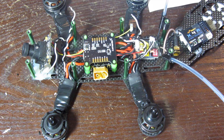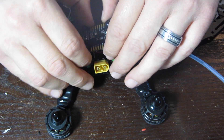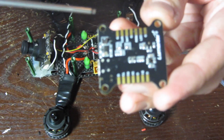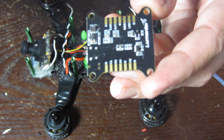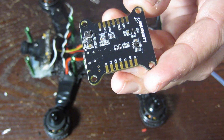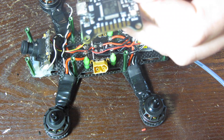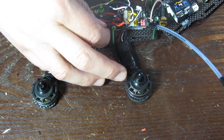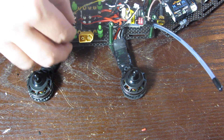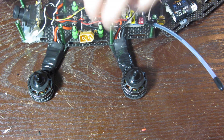As you can see, we just soldered up the SRX to the middle pad and the 5-volt to the middle pad, so now we'll get 5 volts and serial RX signal to the RX and 5-volt pad. They provide you with O-rings to put on your standoffs — these O-rings are going to protect against bad vibrations reaching your flight controller.